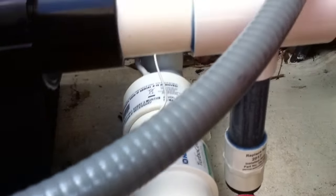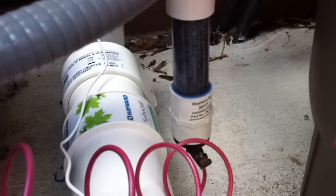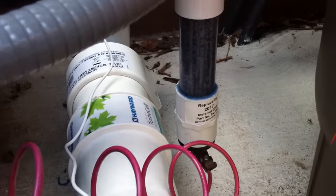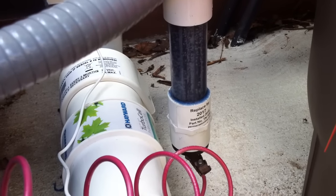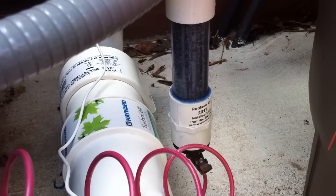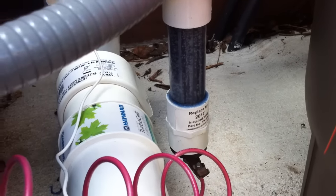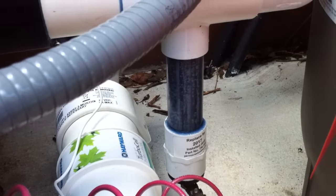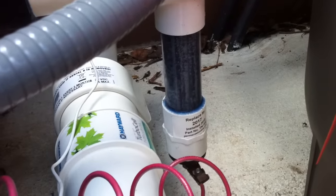One thing that we passed over — you didn't see because I was looking at it from the top. That right there is my favorite thing. That is a sacrificial anode designed to prevent against the effect of galvanic corrosion in this pool. It doesn't 100% protect the system, but it certainly makes a big difference, and it's something that every swimming pool should have — not just salt swimming pools. Every swimming pool should have one, but it's especially important for salt water pools. So that's really nice to see.